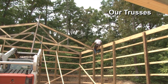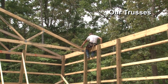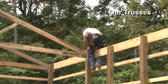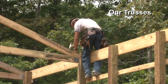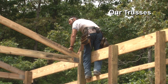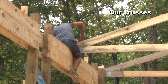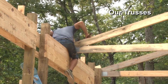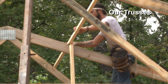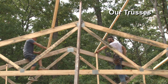Some of our clients are going to want sheetrock ceilings. It's uncommon in a pole barn, but when it happens, the best way to tackle that is usually to go ahead with two-foot center trusses. A lot of those are barndominiums where people are going to finish them off, insulate them, use them as a residence — we do that a lot. But my main goal is to figure out what the client wants and help them get there, whether that's the cheapest route or not. We work within their budget and with what they want to do.